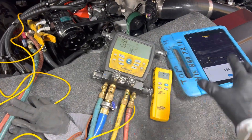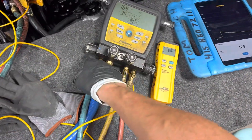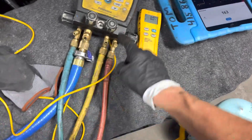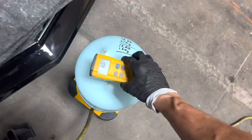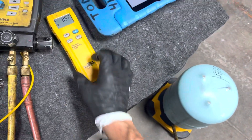We know I can't get all the moisture out. I'm about to fill it. I have the high side open, the low side closed. I have the vacuum open right now — we're still pulling the vacuum. I have the refrigerant off. It's stabilized. I zeroed it out, let's make sure it's reading. We're reading. That's the weight of this, so we are reading.